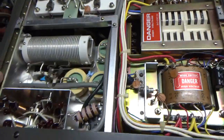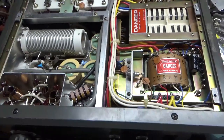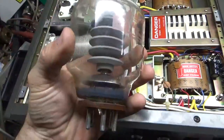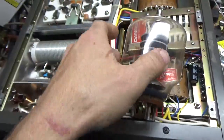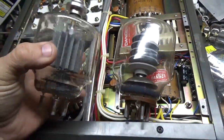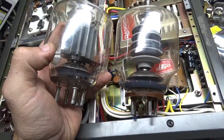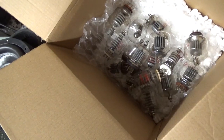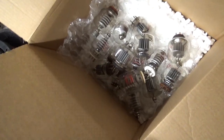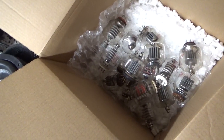I want to show you some of the tubes I've accumulated over the past month or so, just to give you an idea of how many amps I work on. Here's a graphite plate tube — it looks a lot different than a steel plate tube. These have a higher plate dissipation, about 100 watts over a steel plate. This one is an EIMAC, this one is Chinese. These are tubes I've accumulated — I just give them away if people want to make lamps out of them. Cool to look at if you want to make some sort of desktop display piece.